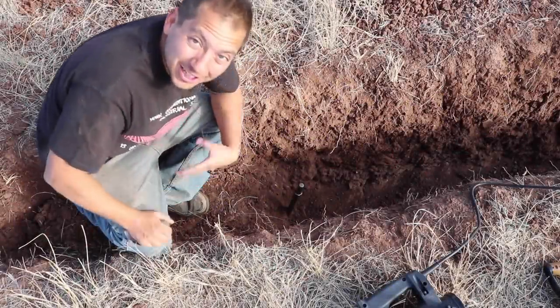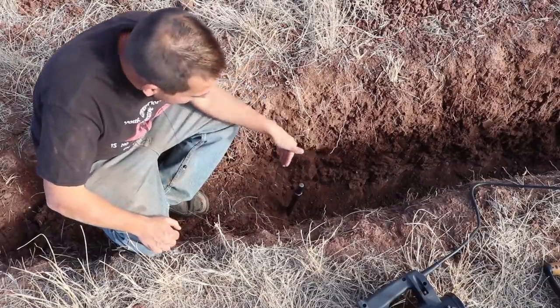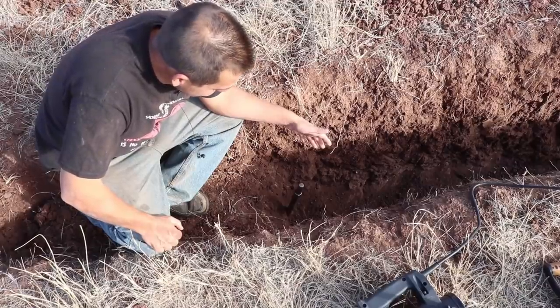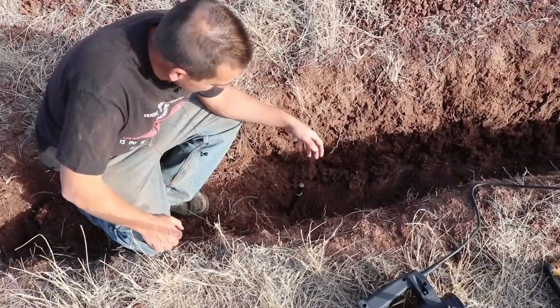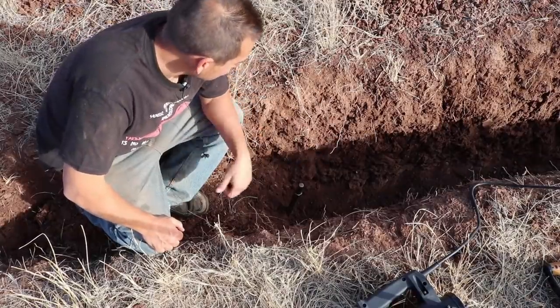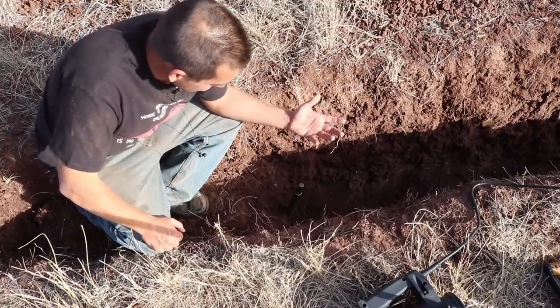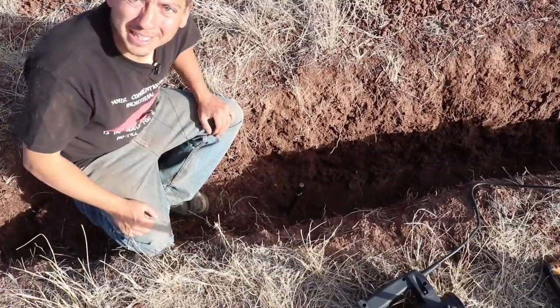Okay, so one thing I learned, be careful where you're using the jackhammer. I went in at an angle, kind of far away from the edge of where I was working. So I mean, this thing just got stuck. I could keep going deeper with the jackhammer, but pulling it out is just impossible, as if I had cemented it in there. So since I'm not the king and I can't pull this sword out of the stone, I'm gonna have to find a way to get this thing out. It's in there really good.